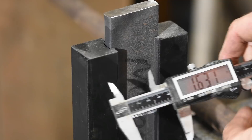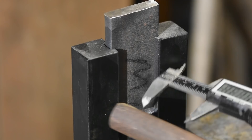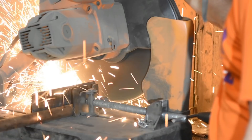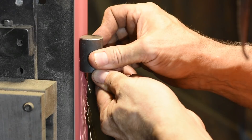I need this little round piece to fit in the space with a little play on both sides so that it doesn't bind, so I cut it well short of the width of the channel. Chop it off on the abrasive saw and deburr it. Then I'll grind it flat on the bottom where it'll mate with the body of the die. And really that's all there is to it.